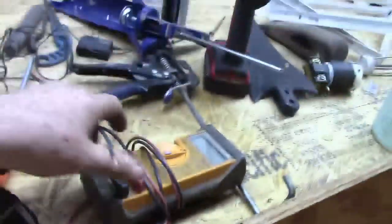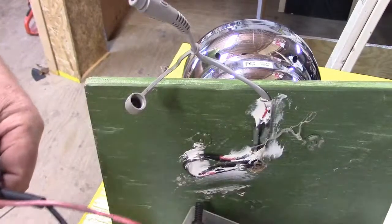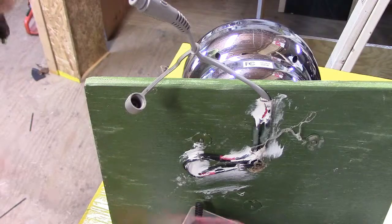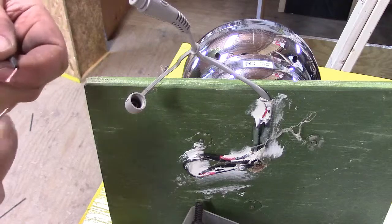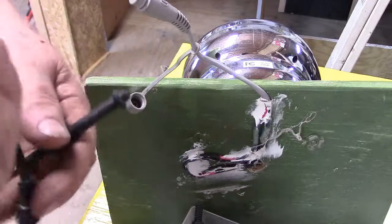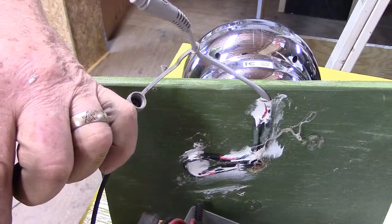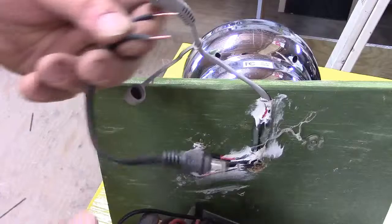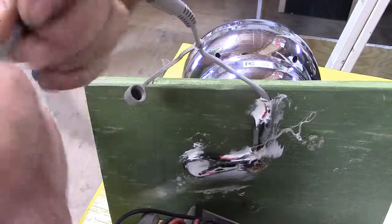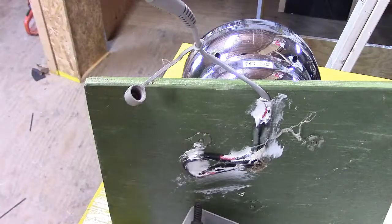It was under my hat! Okay, so now that I found the meter, I'll put it on noisy ohms so I can get a beep and don't have to bother looking at the meter. Let's see what we come up with — I'm on one wire, and that's going to give me center. So this one is center, and that's the one that's got the grooves in it.